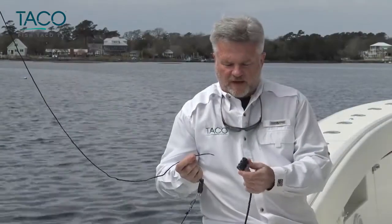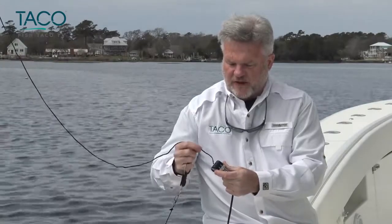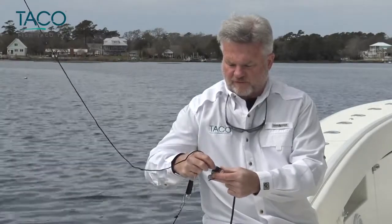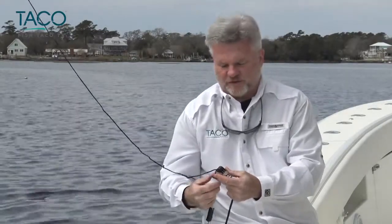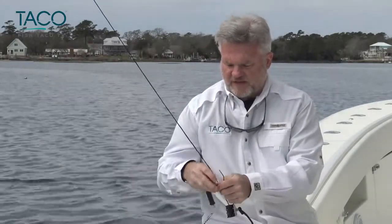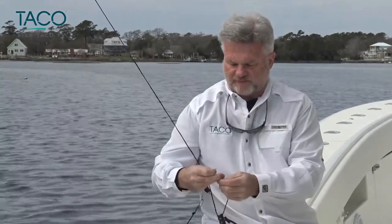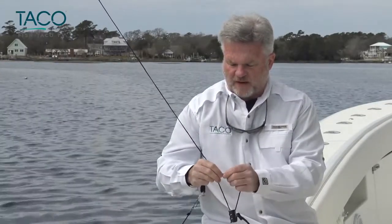It's time to go ahead and rig the Ronstan triple block. We want to make sure that your halyard line goes through the front aft portion of the block, comes through it, and then attaches to the swivel, which is already attached to the release clip. Tie your arbor knot and you'll be ready to go.